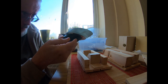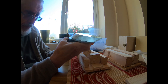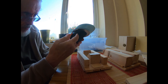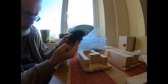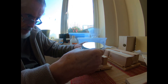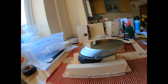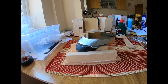The magnets may not hold it absolutely if the telescope were to swing around and hit the pier or get bumped — if it were just magnets holding that, it might jar and move. But I think with three magnets, which are really powerful, plus that bolt pulling everything down, it should be hunky-dory. So there it is in its little 45-degree cradle, which I use just to assemble things, and that should do the trick.